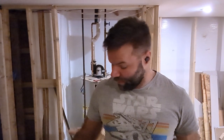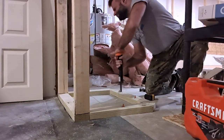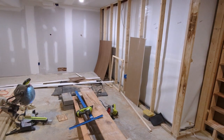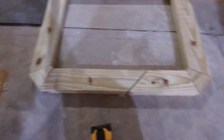We're going to be attaching the frame we made to the floor. We got a ram set for that. Because the piece of wood I cut was so small, the nail split it right in half — it flew over that way somewhere. I heard it hit that brown piece of wood. So I went back in and cut the piece that blew up.